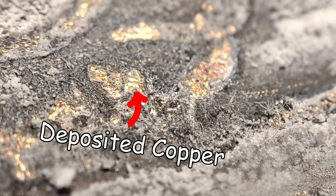Before anyone is going to be in the comments like, Edison-Lalande cell is a primary cell, it's not rechargeable, wah! Yes. The cell has a fairly limited number of recharge cycles due to electroplating happening within the cell. But it's still rechargeable. So it was a no-brainer for me to start experimenting with this battery chemistry instead.